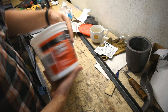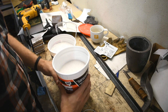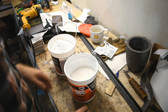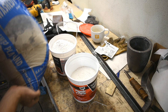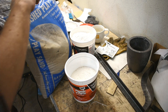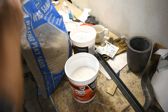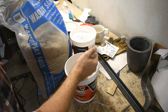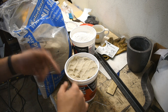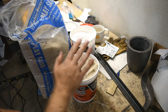Now we have two buckets of plaster of Paris. This is how I get them from this company — they come in this plastic tub, which works good as anything for making the molds. I'm going to dump some of it out. This is a tip given to me by the guy who runs Chirpy's Tinkerings YouTube channel — he's a friend of mine and he has yet to give me bad advice. I'm going to fill the rest of this, not to the top but a decent amount, with play sand. The idea is this increases permeability, so when I burn it out we can get more of the water out of there. It'll also hold it together a little bit better when I dump 1500 degree aluminum in there. This is just play sand from the store. This might seem like it's a bit too high, but when you mix in water, the level will drop a little bit because there's a lot of loose air, especially in the plaster, and a lot of the plaster is going to filter in between the sand grains.